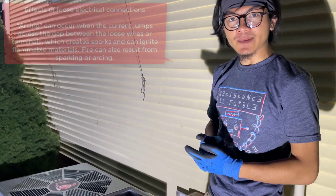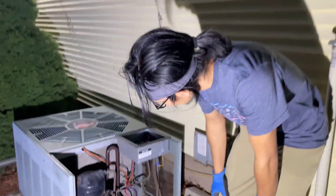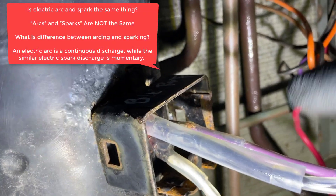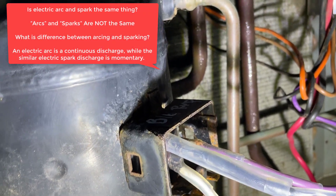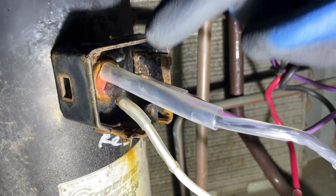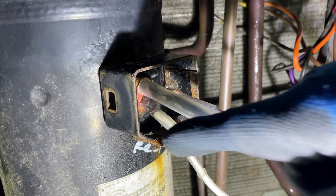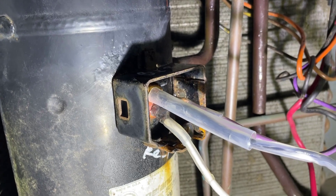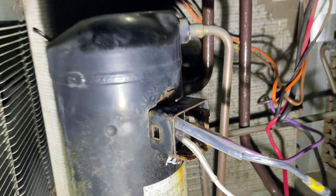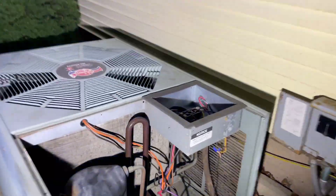We think the issue right now might be there's a bit of a gap — it's not completely airtight, the heat shrink. So we're going to go back and try to seal up that heat shrink. We can't use glue because that part is rubber and there's foam that goes inside, so we don't want to melt that. We'll probably use a heat gun and try to seal it up. At least you can see condensation right now, which means it's getting cooler.